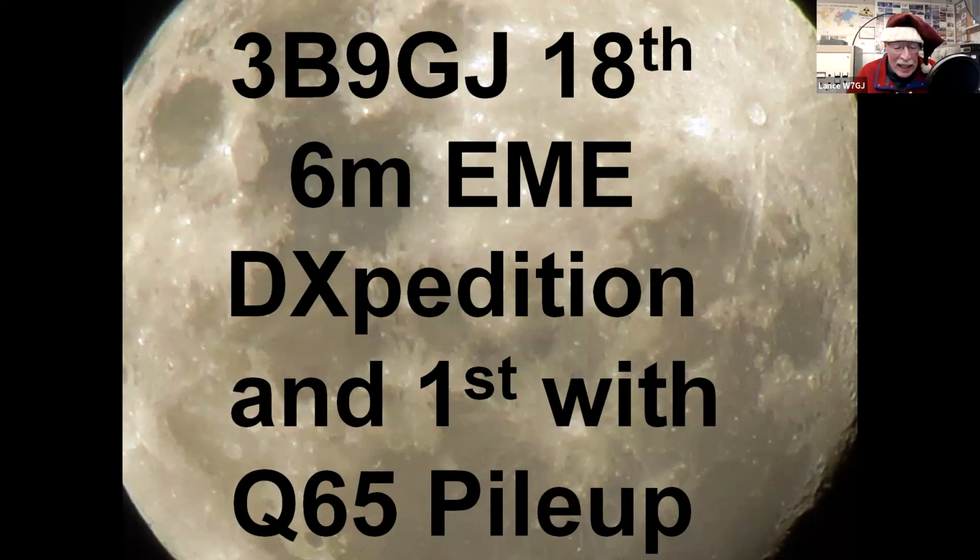So basically, it makes a call3.txt file. If you're familiar with JT65, it basically makes one of those for each day. But the way it makes it is it has to decode the calls once, and then their frequency and their call sign and their grid are in the file. So it really makes it very, very easy to decode those stations. Again, you don't have to be on their frequency to decode them. If you are on their frequency, it decodes them, I think, 1 dB better.